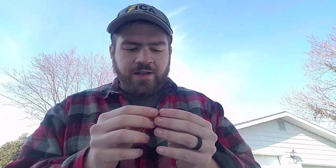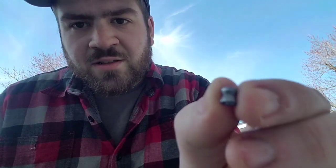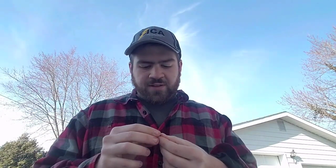In between the rifling cuts the lead should be smashed down and pretty concentric all the way around — that's how you tell. If there's no choke or hardly any choke, you would just barely see the cuts from the rifling on the pellet, kind of like what the tail looks like. The tail does have some cutting on it, but not as bad as the head since the head is bigger than the skirt. With a choked barrel, the first driving band shows a really wide surface area of deformation.